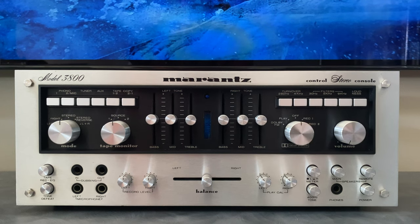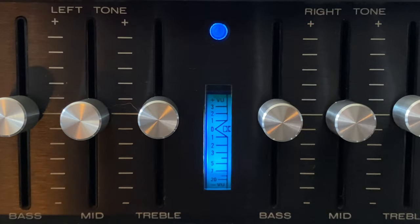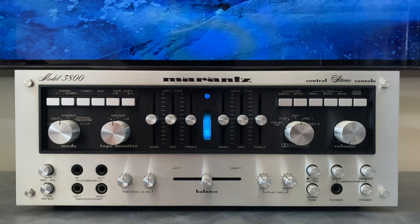Looking at the front panel — when the unit powers on, you'll notice the needle jumps up and down a little. Marantz implemented a circuit with about a four-second time delay: when you power on the unit, a little reed relay on the left side clicks and allows audio to pass through. This protects against power-on transients. When you turn on the unit, the power supply charges and the voltage regulator starts to work, and they don't want any of that weird audio signal getting to the power amplifier. So there's a four-second reed relay controlled time delay.